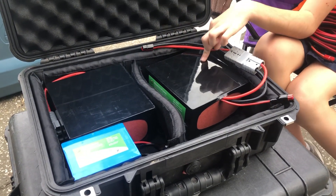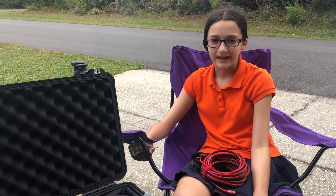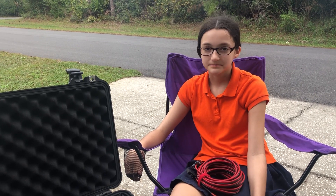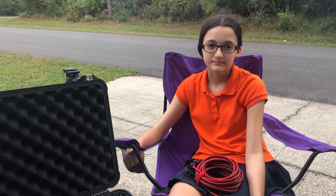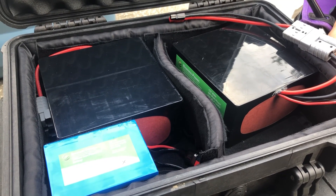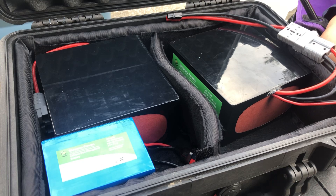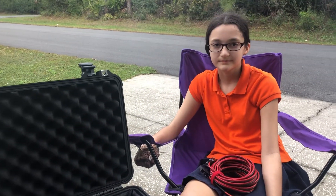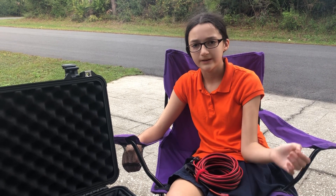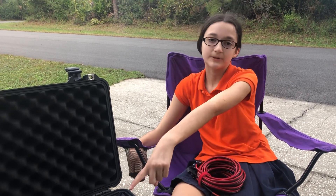I also forgot to mention, we like these batteries because lithium iron phosphate is much, much lighter than lead acid and they're also a lot smaller. You can charge these things like 2,500 times where with lead acid you can charge like 400 times — so that's a big difference. These 30 amp hour batteries give us about the same runtime that we got with a 79 amp hour lead acid AGM battery, and that weighed 70 pounds while these weigh about seven. We don't have to use any kind of battery booster, and remember — when we put that battery booster on, the RFI went really high, and when we transmitted digital CQ it would all drop and shut down. But these don't do that.